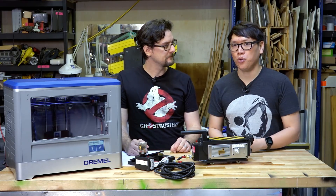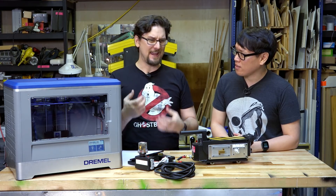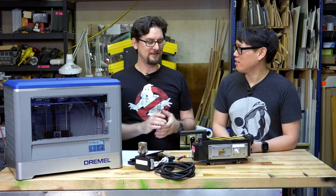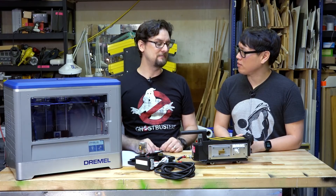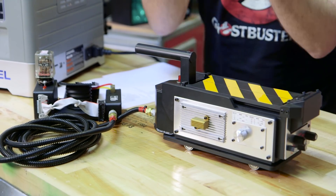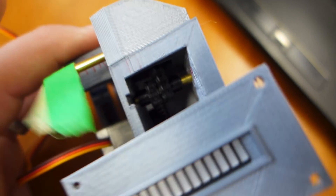You have the original parts sourced, modeled, printed, assembled — and then there's functionality. I hate it when you get a cool-looking prop replica and the ammo cartridge won't come out or the trigger doesn't work. So I tried to replicate everything I really wanted. Lights and sound were a must. The doors had to open, which turned out to be the biggest problem to solve — in the movies there's the trap that only smokes, the trap that only rolls, and the trap that only makes light. This has to be all combined into one unit. I didn't want little rods sticking out the top, so I had to figure out a way to make the doors open and close without seeing the mechanism. There's a whole chain drive system hidden in the front unit that opens and closes the doors, activated by the pedal.